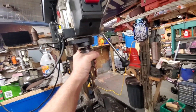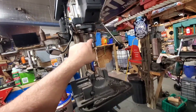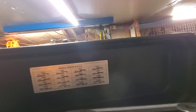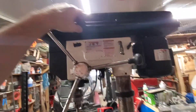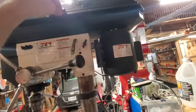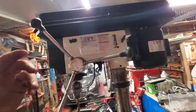I went and bought a new chuck — a three-quarter inch chuck to put in here, not a half inch. I want three-quarters in here. I've geared this all the way down to first gear basically, so my RPM on this is around 290 RPMs. The head is spinning at wide open at 3,630 RPM — I'm like, why are they spinning so fast? You'll smoke your drill bits like that, so I turned it all the way down.